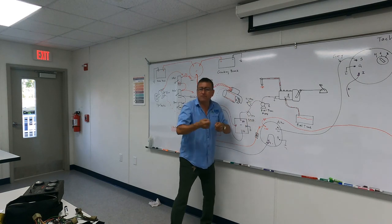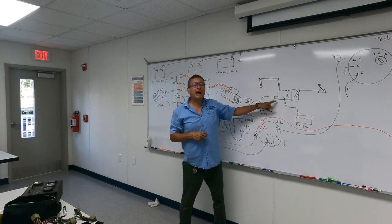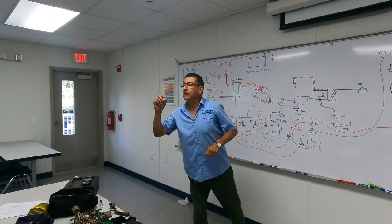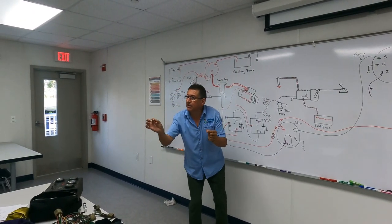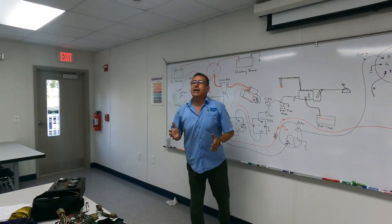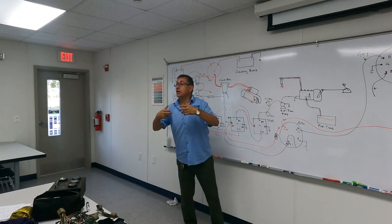I disconnect the output of the pump and I have fuel. Okay, I put it back. But this one, nothing. The fuel injection pump solenoid does not receive current. Let me bring one alligator cable, positive, directly from the battery here. Click, and the engine starts immediately. Okay. I have a problem. Probably the cable is interrupted.